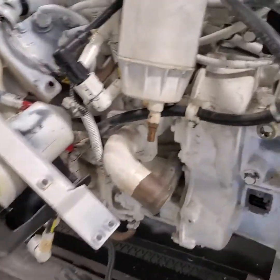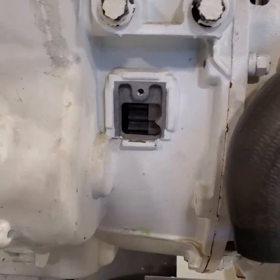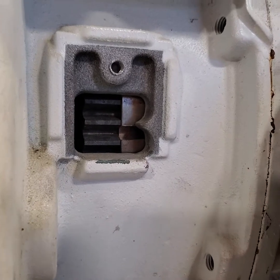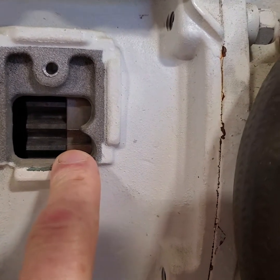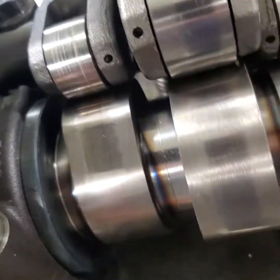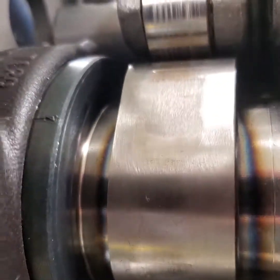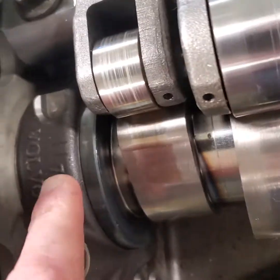I'm going to come around to the back side of the engine. I've taken the plate off. Here's the reverse gear of the engine. Coming around on the port side, there is an opening here and you can see the flywheel and that slot — that's going to tell us exactly where to time the engine to get us to top dead center. There are marks on the camshaft: there's a mark here, and further around the corner there's another mark — a 2 down there — and this mark up here is a 4.